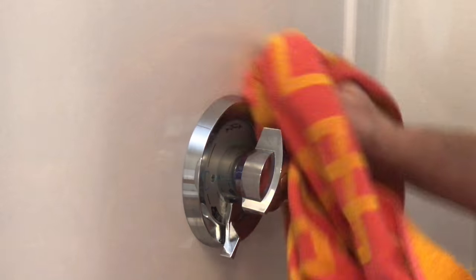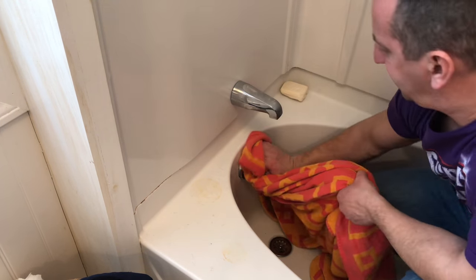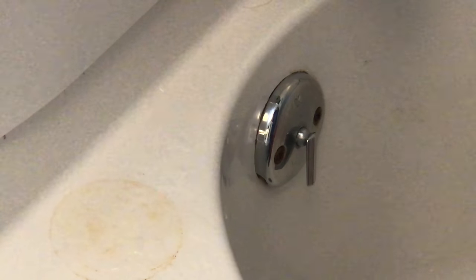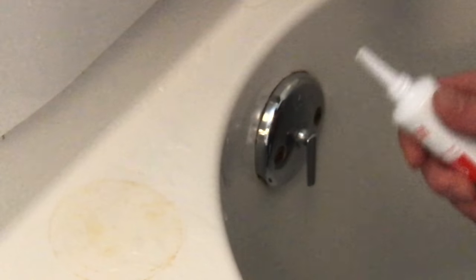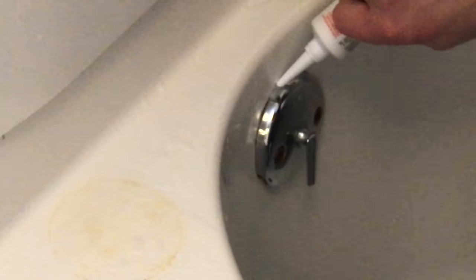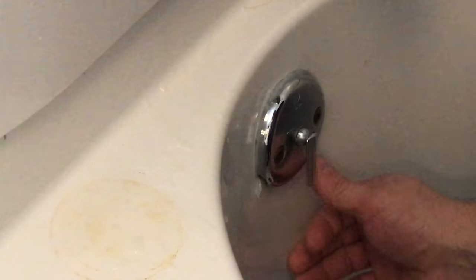So what you want to do is make sure everything is clean and dry — just get a towel and dry the surfaces. I'm going to dry out the spout and get everything nice and cleaned up. I purchased some clear silicone sealer made for tubs and showers, from Home Depot, but you can get it at Lowe's or any hardware store. Just run a thin bead along the area, and make sure you don't close up any of the openings underneath. Then take your finger and wipe away any excess sealer.